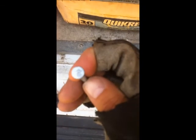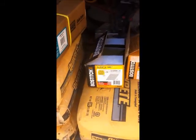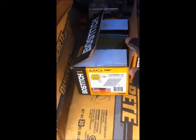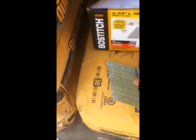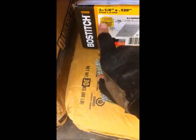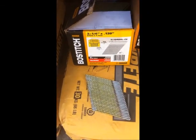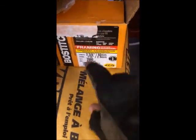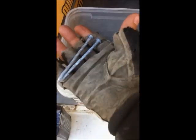These nails are rated number 10 for strength. We're going to be doing some gun nailing with a stick nailer — three and a quarter inch galvanized stick nails. It's very important to have the yellow sticker on there, as these are rated for pressure treated wood exterior. We'll also be using two and three-eighths nails, plus common galvanized spiral framing nails.